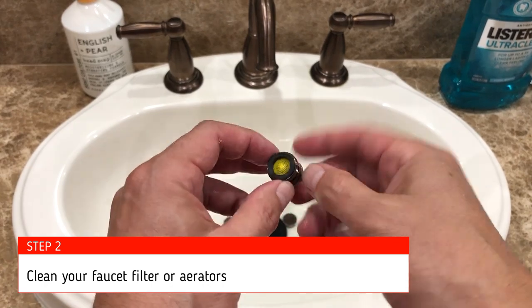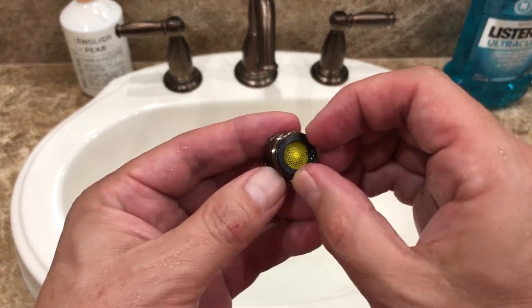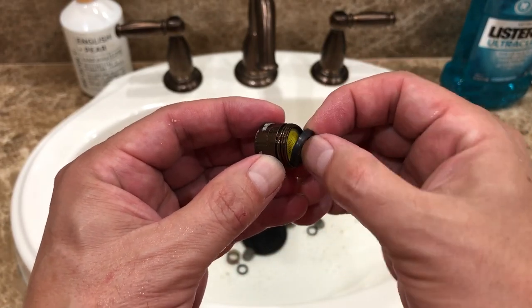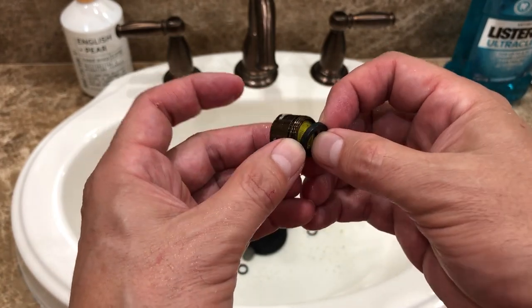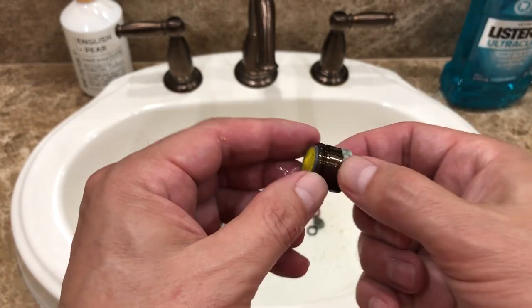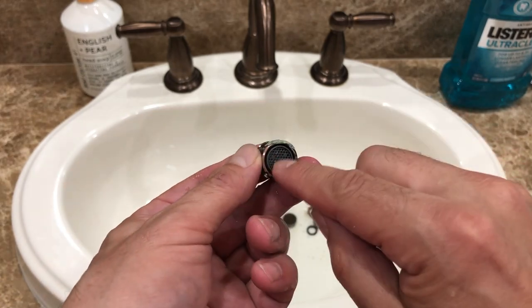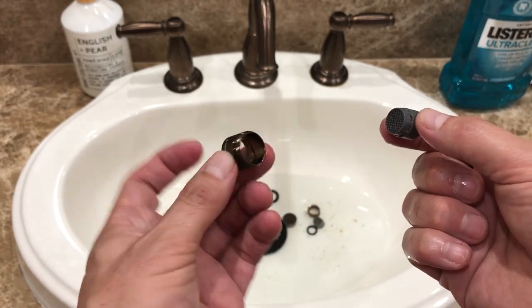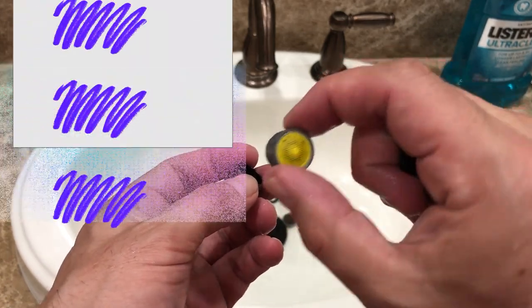My next step — these actually come apart. This is actually a cartridge inside. You can pull off this little washer here; just get a little fingernail in there and the washer should come right off. You may have a different type, but I'm showing you this type, and to be honest I don't even know what type this is, but the general idea is still there. Once you have the washer off, you can push this out — this is just a housing for the sink itself, and this is the actual little filter trap.